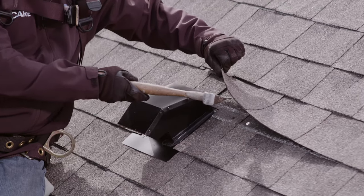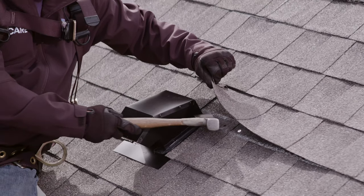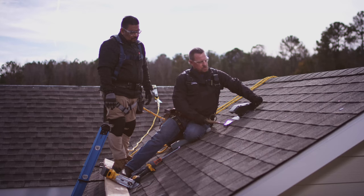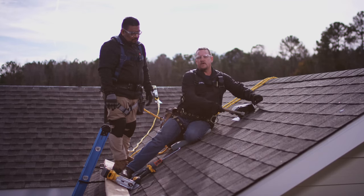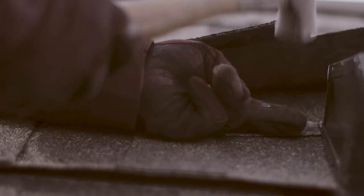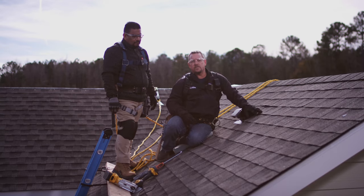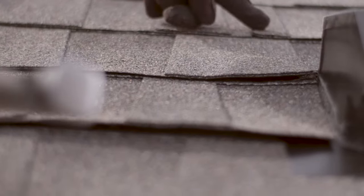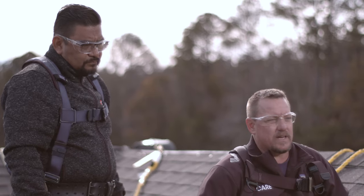Take a look at your seal strips in here. If you've damaged any of those, just apply a little bit of mastic on the shingle and push it into place. Just don't use too much mastic because if it heats up, it'll run down your roof. Now if your shingles stick up a little bit, don't worry about it. This is just a cold weather application — once those heat up, they'll lay right back down.